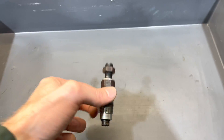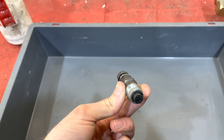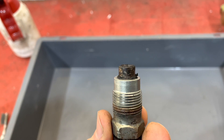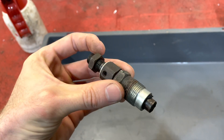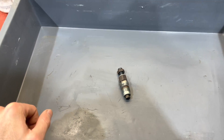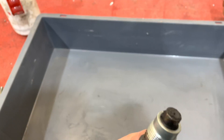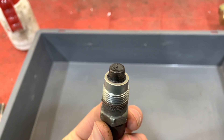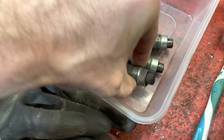In this video I'm going to clean up these injectors. These are from the 1KZ-TE which is in my Land Cruiser Prado. You can see that they are pretty gummed up, so I need to clean all this off. The engine wasn't delivering power over about 2000 RPM - it just feels like a fueling issue. I looked at the injectors and they all look the same.